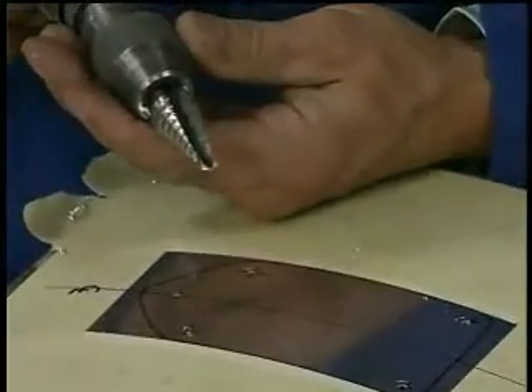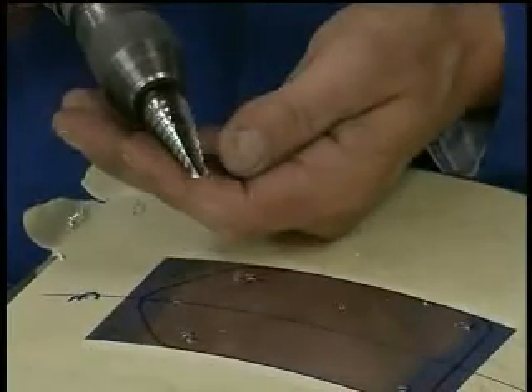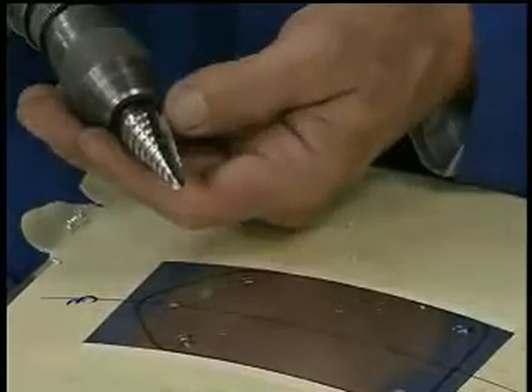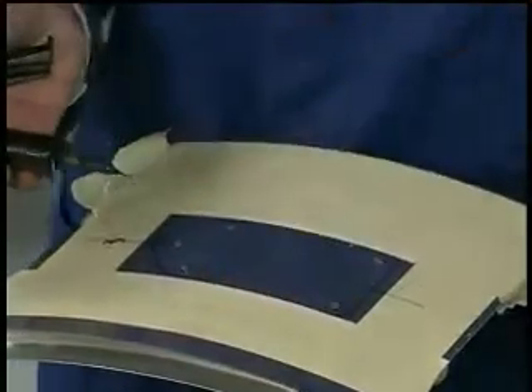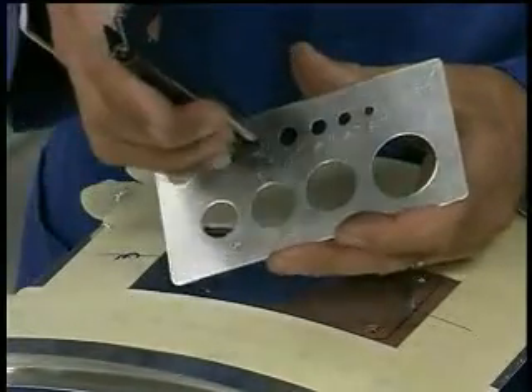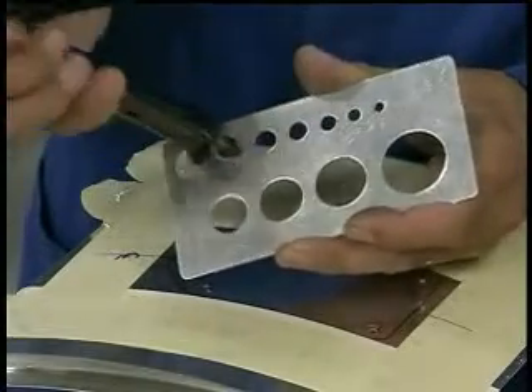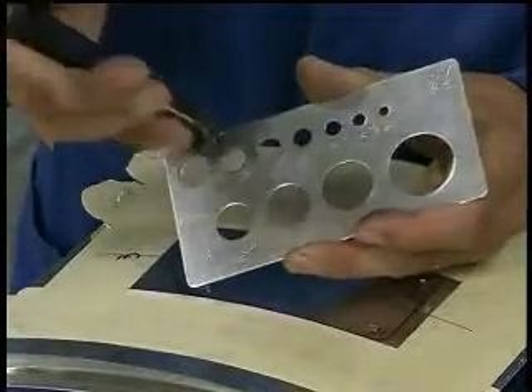I've got some initial pilot holes located within the bounds of the skin cut out area. I'm going to switch to a unibit. The unibit is another method I could use to make a nice round skin cut out if I had the correct size — this one goes from a quarter inch up to three quarter inch. The size of hole needed for my nibbler can be determined by using a hole gauge; it won't fit into seven sixteenths, so I'll need at least a half inch diameter hole to use this tool.